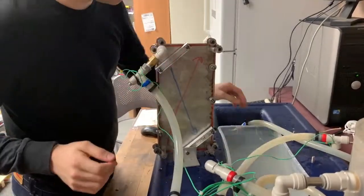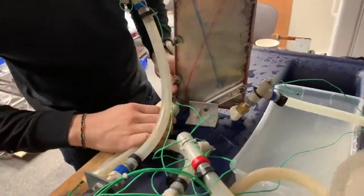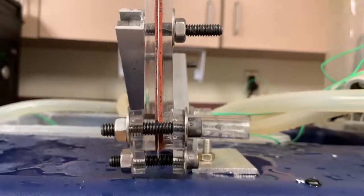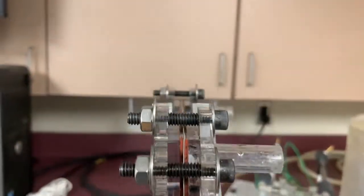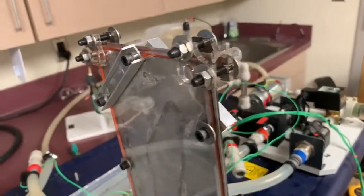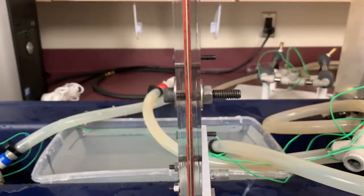The heat exchanger connects to the testing unit properly at both inlets and both outlets. The tubing is made of polycarbonate, which is 1/2 inch outer diameter and 3/8 inch inner diameter. For additional compressive force, we manufactured acrylic clamps located at the 4 corners of the heat exchanger. These are secured to the heat exchanger using acrylic glue and fastened using bolts.